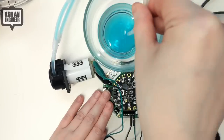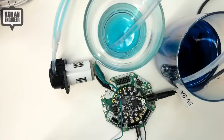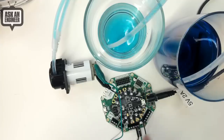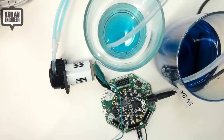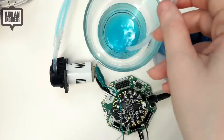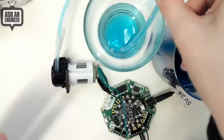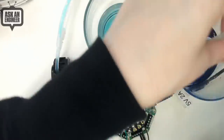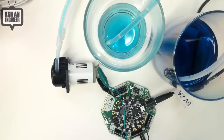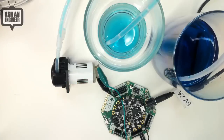And then it can also, of course, remove liquid by putting the motor on a motor port. And then on your H-bridge, you go forwards or backwards. You can move fluid in or out, depending on which direction you set it to be. So it's good for all sorts of liquid movements. It's pretty fast, and what's really nice is you don't need to prime it. So it can sit separately outside of the liquids that you're using.